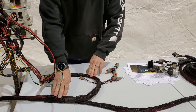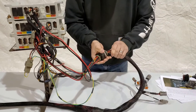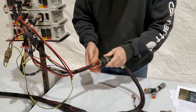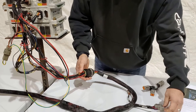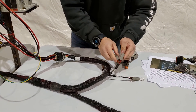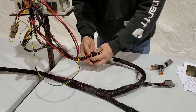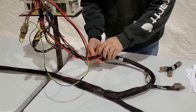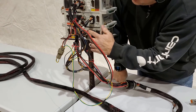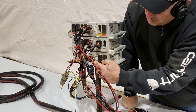Spliced into the harness on the four gauge wires, we've got the power for our ECU stack. Pins 8, 12, and 16 are going to be our power going in to power our ECUs — they're spliced off that main line. There's also a wire spliced off going to the safety switch, and two wires spliced off going to the auxiliary power harness. These then splice off again, providing ECU power and power for our power plug. ECU power is two-pin, and the power plug is four-pin.